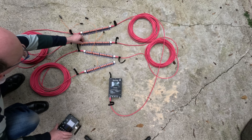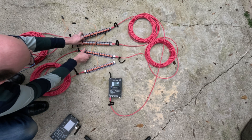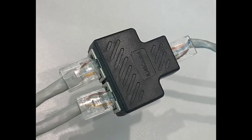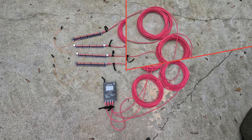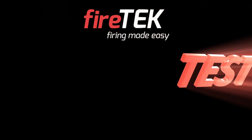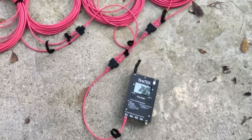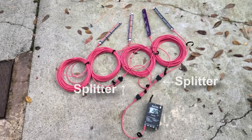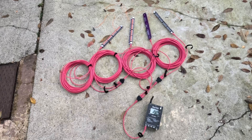But it's not all doom and gloom. A few days after mulling over the somewhat disappointing results I came up with an idea — would using RJ45 splitters make any difference? An RJ45 splitter basically allows two network cables to be connected to one. In all my previous tests I'd connected rails directly to the module or daisy-chained them. For test eight, rather than daisy chaining four rails from a single port, I connected a short 50cm cable to one module output port, then connected a two-way splitter, then two more short 50cm cables, then two more splitters — giving four cable outputs from a single port. Onto each of these I connected 20m cables to rails, with a talon connected to each rail.